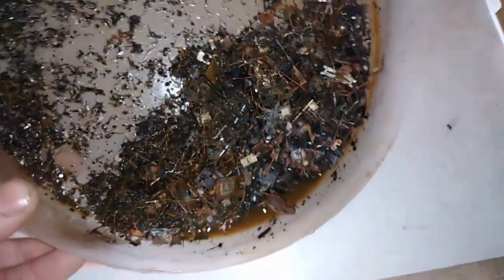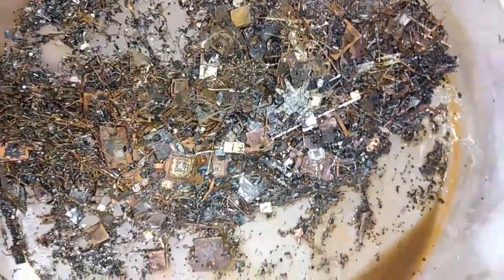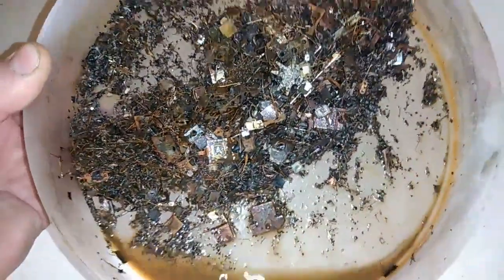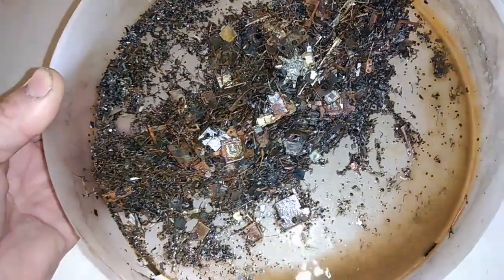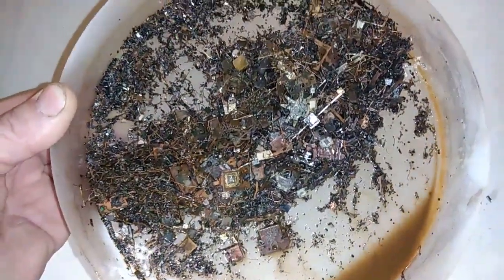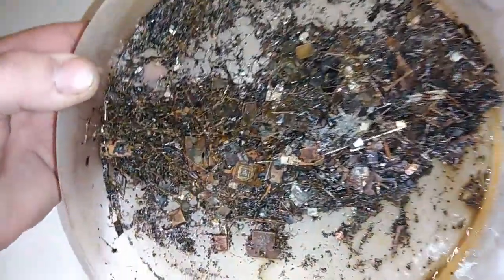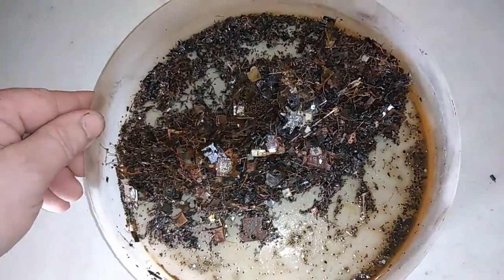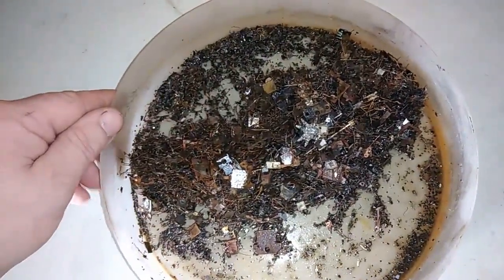Dusan here. In today's video we got some special test video for you. So remember, this is the material which is left from my last video, when I recovered from 1 kilogram of mixed ICs, LED diodes, RAM ICs, and three-leg transistors. I recovered that 0.4 gold, and this is the material which is left after burning and grinding chips and removing the ash from this metallic part.